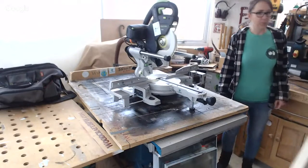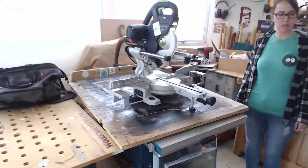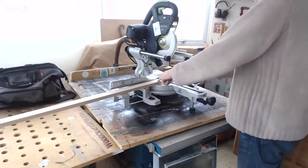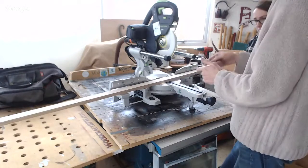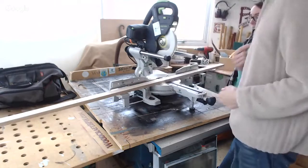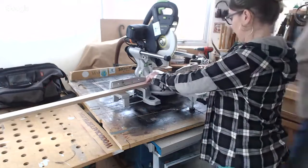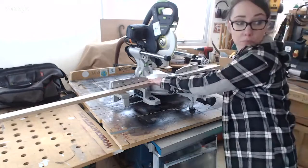Right. You used this before anyway, haven't you? Right. If you cut, there's a little bit on there. If you cut that bit off, because that's our bit of waste, what we'll do is when you cut the angles so that it doesn't spew out the back, we'll use that bit of wood and I'll clamp it to the back of the fence, and you can cut through that, and you'll see what. Yeah. You also make it easier for lining your bits up as well. Gotta have your bits lined up. Absolutely. I'll just grab some clamps so we can clamp those.